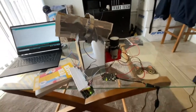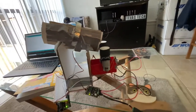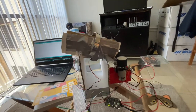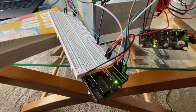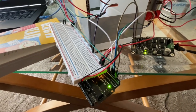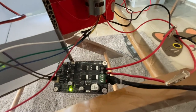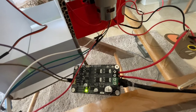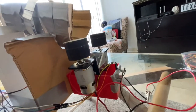Hello world, this is the automatic ball launcher — just a proof of concept to make sure all components work. Here's a walkthrough: this is the Arduino, which is like the brain of the whole system. In order to get the motors to work, I needed a motor driver to supply high voltage and high amps for these two large powerful DC motors.